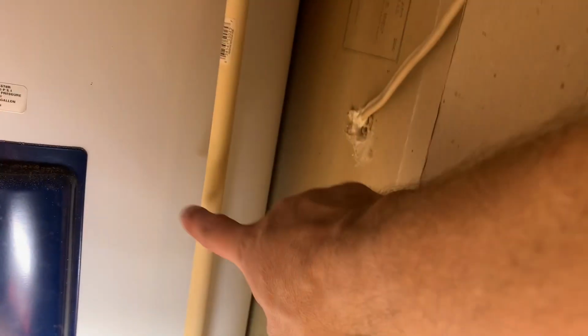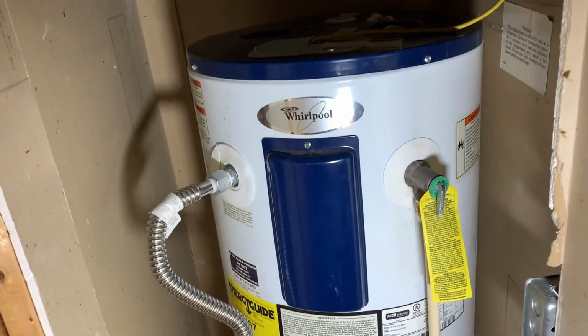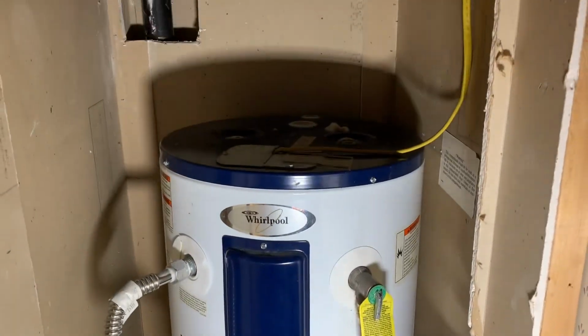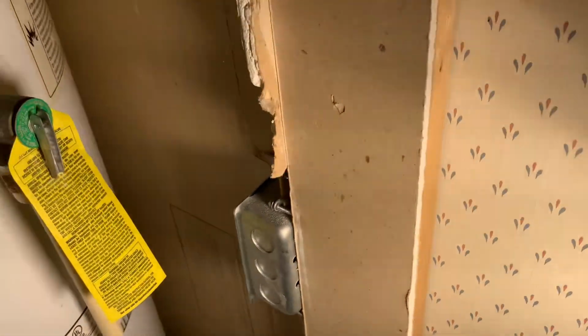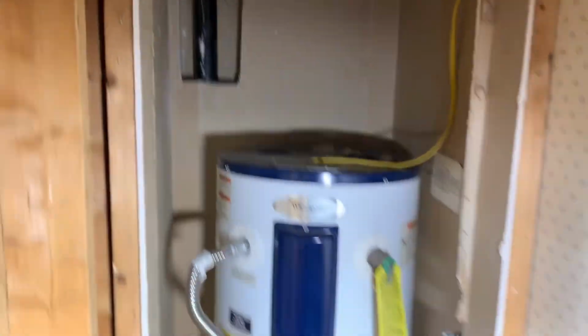And this is the vent to the outside as well. You can pull this here and it'll shoot water on the outside of the house. What that does is it's made to bleed the air out the top of the tank, as well as if you're draining the tank, you've got to get air in behind it so that it'll drain. So anyway, I also put in a junction box right there to keep the electrical connections from being exposed. And there is my vent one-way valve.